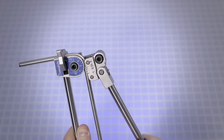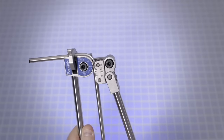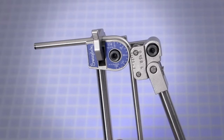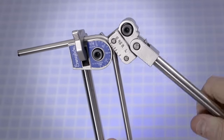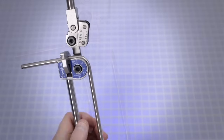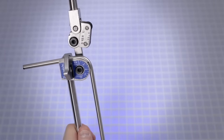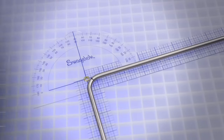To adjust for spring back, lift the bender handle and repeat the alignment of the tubing with the roll support. Then measure the bend with the bender scale and bend an additional two or three degrees as needed. After completing the bend, swing the short handle up and away from the tube. Pull the tube latch off the tube and remove the tube from the bender groove. Verify the bend angle using a protractor, template, or against a known angle to ensure the desired bend angle has been achieved.